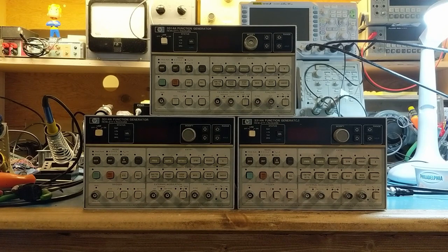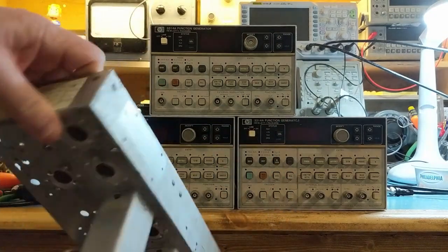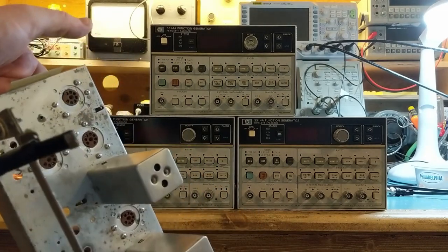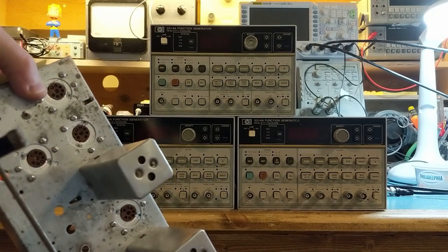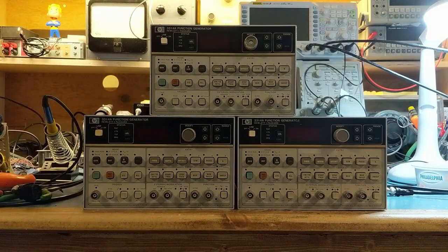As an example, here's a chassis that I came up with. This is an older radio that had Philco Loctal tubes in it, and just for fun I was going to put in some 7-pin miniature tubes. So just use like the 12BA6, 12BE6, 12AV7, 12AV6, and so on, on an AA5 radio. See if I can upcycle the chassis. But that and some other options are available for future videos.